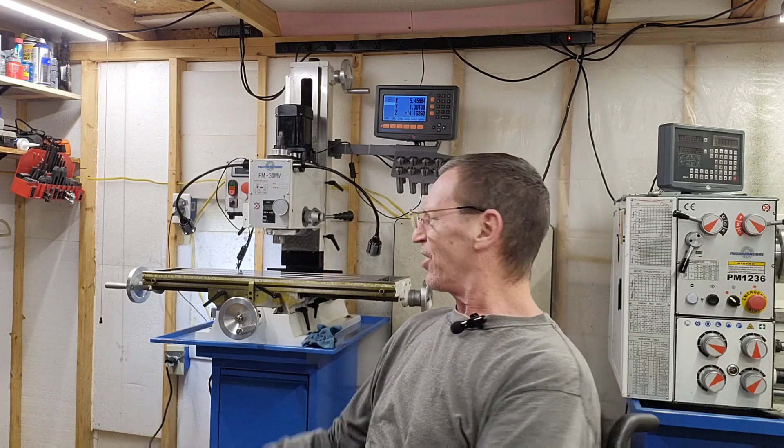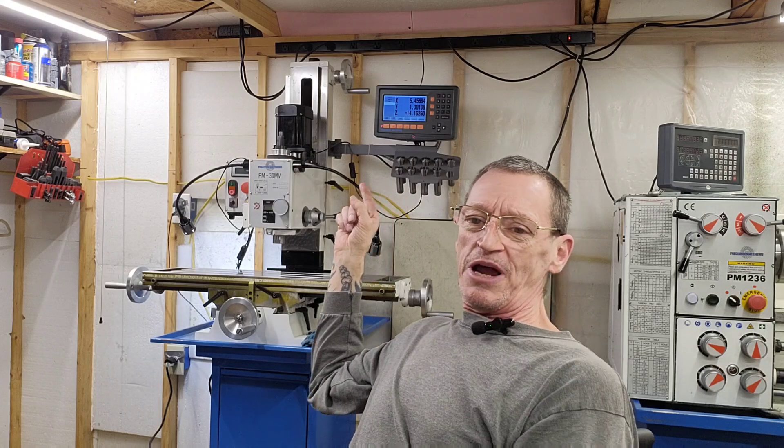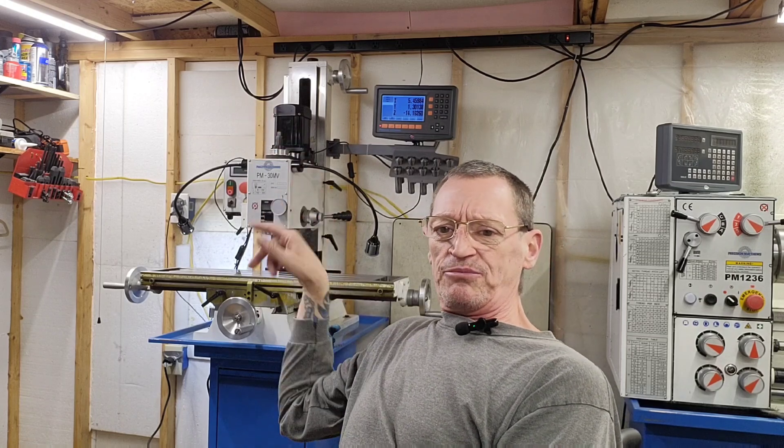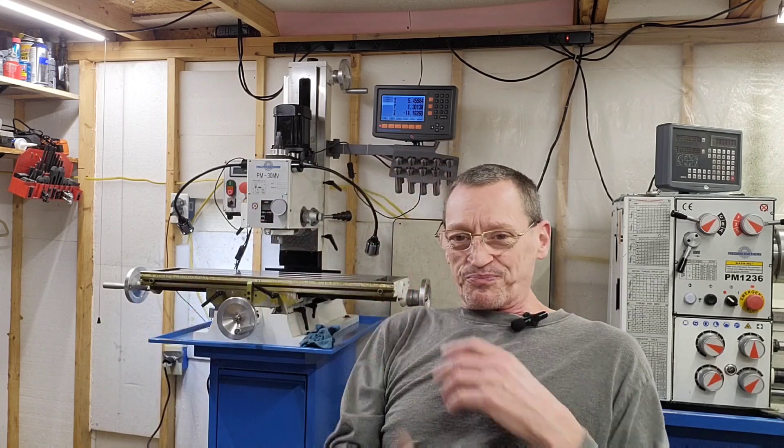PM30, 350 hours — excellent milling machine. It has done the same thing the lathe has: it's just broken in and gotten better and better. Smooth as glass. The variable speed is awesome. I leave the top of it off — it doesn't get any debris up there and I pay attention to keep debris away from the pulleys. You can change speeds very fast on this machine, just a couple of minutes and you're on the next pulley. I've had such great torque with this machine that I've left it on the high pulley and I've done some heavy, deep cuts and it goes right through — you wouldn't even know it was on the high pulley.